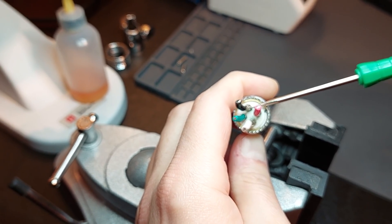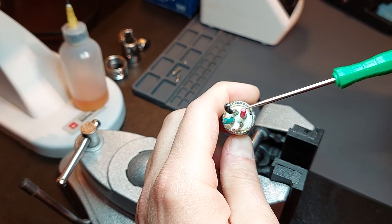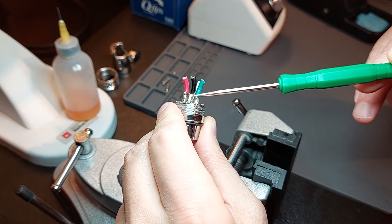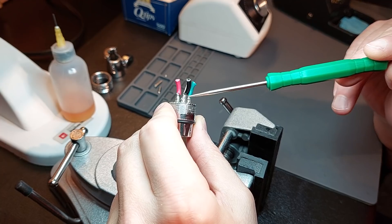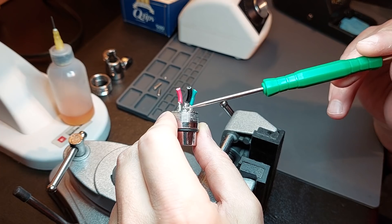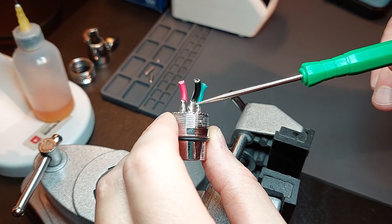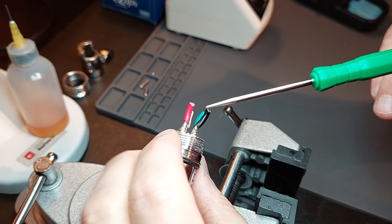These are brass conductors, and you can see I can take this probe and go inside there — that's a definitive issue. When you get these blobs, there are a couple of different reasons for this. Typically it's solder being used without the proper amount of flux, or flux that's not high quality. It could also be a heat issue, but typically it's a flux issue. There's not enough heat with that flux to actually clean the conductor and get proper penetration — that's what leads to a blob.